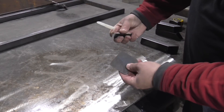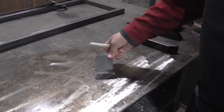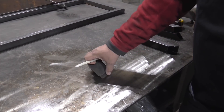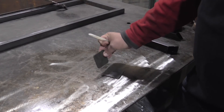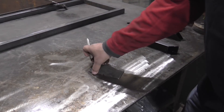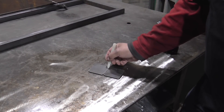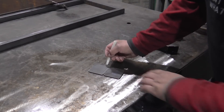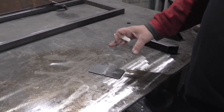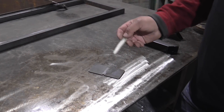If you look at plate material — this happens to be 10 gauge, 135 thousandths — you can do the same thing: open root, butt joint, lap joint where you're almost doubling the material thickness, or a T joint with an extra heat sink. A lot of people won't know what a manufacturer's settings are really calibrated for — some figure a butt joint, some a lap joint, some a straight push or pull, some with torch manipulation like swirls, cursive E, up and down, or C-shape motion. The slower you go and the more gun manipulation you do, the higher your heat input on the part — that's also how you weld thicker material with a small machine using multiple passes and a lot of gun manipulation.